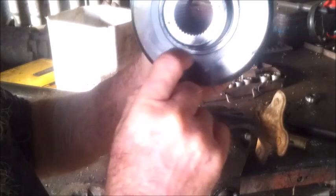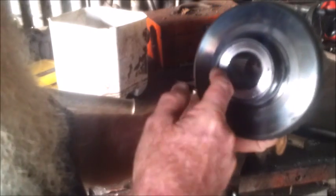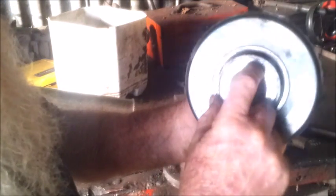Well, I've got the job done. The piece that was sticking out, I machined it back flush, so it's come up quite nice. The original idea was to drill and tap it and Loctite some threads in there. It's called a Scotch key, but there's no way, that's way too hard. There's no way I could tap that. I just got it drilled. So I've drilled on the join where the two pieces go, and I've hammered in roll pins and Loctited them in as well.